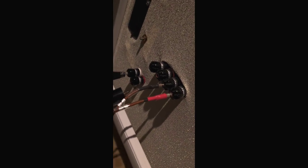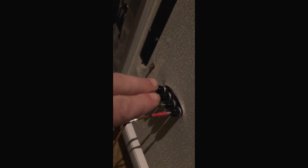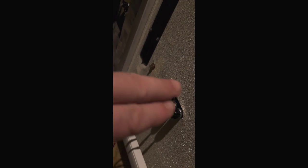On the back of the panel, this is how I put it back together. I removed all the crossover apparatus — the fuse block stuff over here. Now these go straight to the panel. They have silver foil on the back that goes straight to the panel from these binding posts. We don't really need these two because that's the Maggie mid-range, but it's there in case I want to use it for some reason.